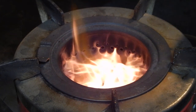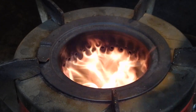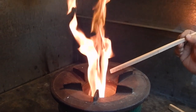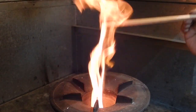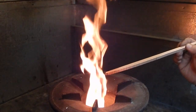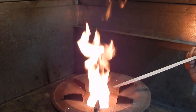Any gases or smoke coming up from the wood is getting mixed into the flame. Look — especially when the flame is this high — where it's burning is at the outside where the oxygen is interacting with the wood gas. But this is a very dirty flame. The oxygen isn't able to get inside because there isn't mixing. Both natural draft and forced draft jets of air are attempting to fix that problem. When you see big laminar flames like this, you know that's pretty dirty.